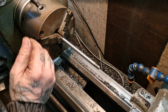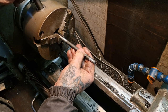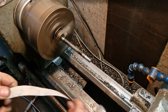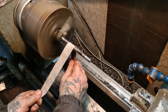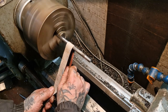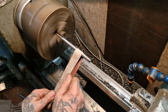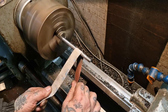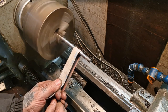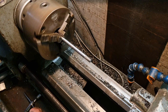I've just sprayed wheels actually — I put it through the centre of the wheel and across my actual stands, so I can turn the wheel as I'm painting it. So as you can see it's picked up a bit of 2K Black, which we'll just have off. This will want chroming — or nickel plate, zinc probably. Bright zinc plate — yeah, that's just the ticket for this kind of thing.